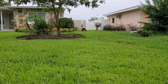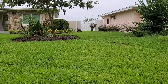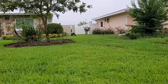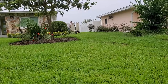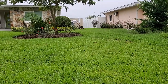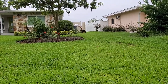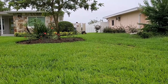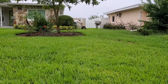Maintenance of drains — French drains, especially French drains. All this talk about no debris getting into the line is such a bunch of hype. Debris gets into your line: sand, clay, it all gets through — it gets through the fabric. And it doesn't matter; that line needs to be maintained. Catch basins are not how you maintain a line. You maintain a line by cleaning with a jetter or with a drain cleaning machine, which you've seen us do thousands of times. I've got hundreds of videos up there showing you how to do this. Very important.